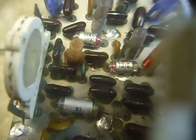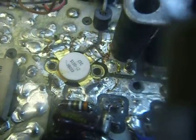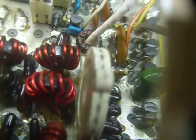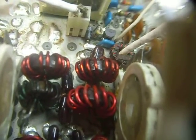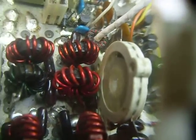All of the parts for the input high pass filter here appear to be OK — they appear to be all in there and of the correct values, so that's pretty good. But these other things have all got to be taken care of. One thing that's different on the SS8000 from the SS9000 is the fact that right here you have the coil for sensing the SWR — that's for your shutdown. If the standing waves are high it will shut down. But on the SS9000 that's on a separate little circuit board in a separate little box. They didn't have all the WARC bands on this rig so they had room to put that on this board. But when they designed the SS9000 they had to move it off in order to make room for all the toroids for all the other filters for the WARC bands. It's all very interesting.